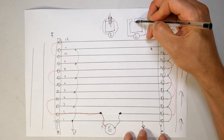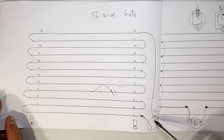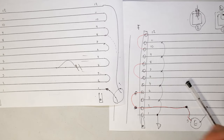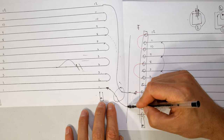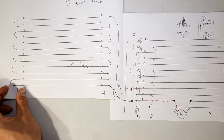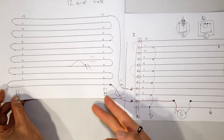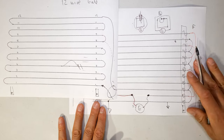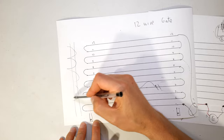When your gate is connected, all you're doing is opening one of these lines and connecting it to your gate. Returning back to the gate, you'll see you have two wires coming in - that is live and that is also live. So you open-circuit that line and use that Nemtek contactor - and it goes like that, maintaining that series circuit. There's your gate. When your gate moves, that becomes closed. The gate moves and closes again, returning to its position and allowing this to be energized, covering that part of your gate.